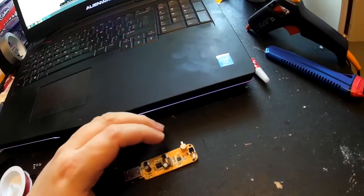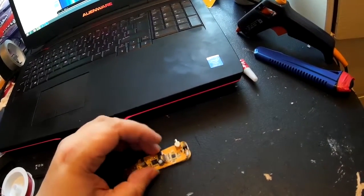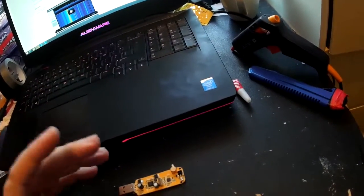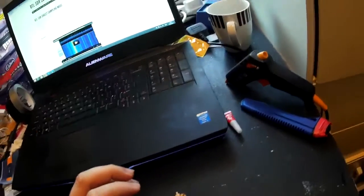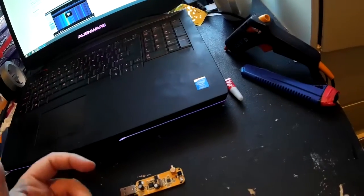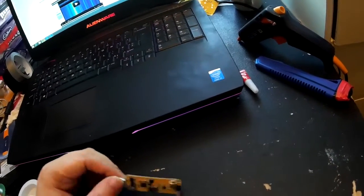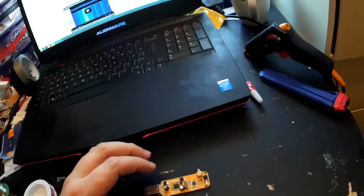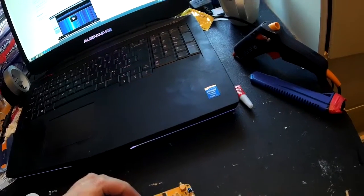Now, you can buy a converter for these, which is called the Ham It Up converter, which will take in the signals from your antenna, boost them up by 100 megahertz, and then these dongles can easily pick them up and decode them. You program in that 100 megahertz offset so that on your screen it shows the correct frequency, although really it's been converted up by 100 megahertz. That's really cool, and the only thing I don't like is that it's a bit bigger than I would have liked, but the board is awesome, and I've even considered buying one, and I probably will at some point.